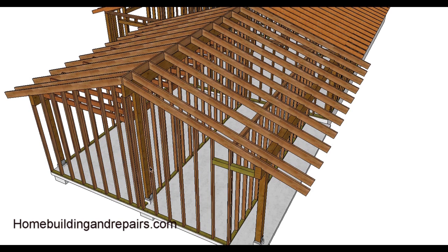I don't think you would need to move this wall. What about moving the post? We would just leave it there. Even if you move the wall over a little, you could make it work somehow by building a little cabinet, closet, bookshelf, or simply enclosing the corner. But if you move the post, you're modifying the building, and this could create problems. The beam might be engineered for the current span - say 18 feet - and if we move it over a foot, we'd change the span to 19 feet, which might actually require a larger beam. Just leave the post there.